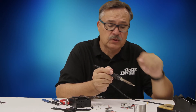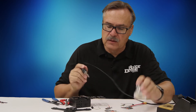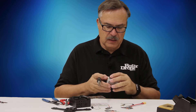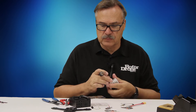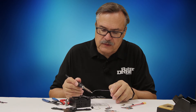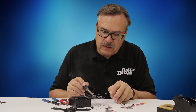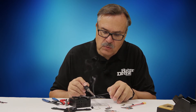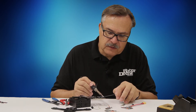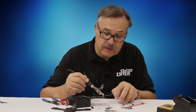Some people use various temperatures, but I like to go all the way high because that way I only touch down for a second. The longer you keep it on there, the more heat you transfer onto the board and onto the parts. So I'd recommend you try out what works for you. The first thing I'm going to do is put a little bit of solder on the soldering iron, because that tends to make the solder melt much, much quicker — so you don't have to leave the soldering iron on the surface as long to get everything heated up.